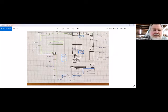You know, this black circle's my air compressor. No big deal about it, but I've had 2 or 3 people that have got the same kind of automatic air compressor setup that I do, where it comes on. Our bedroom is above this section of the basement, and having the air compressor come on at 3 a.m. is not recommended to keep things peaceful. So I've got a switch on that. When I come in, I can toggle it and it'll stay on for a couple of hours and then it goes off. So if the air pressure drops at 3 a.m., it doesn't come on. That's been real useful.